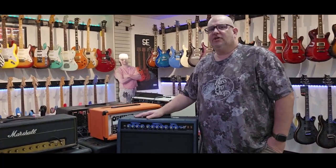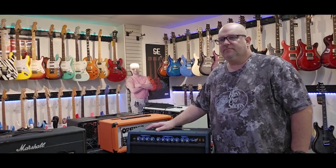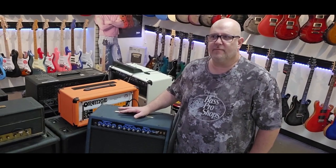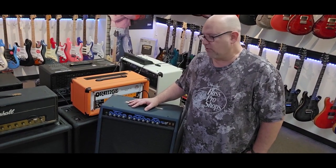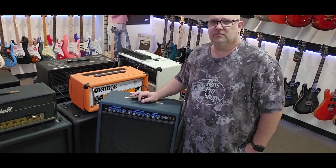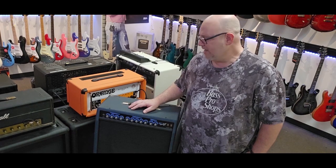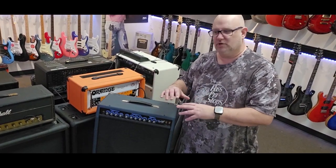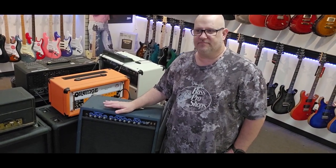Yeah, most of these, they're a little bit lacking on the gain, so we restructure four of the gain stages in this thing and boost them up. And then they act like they have a kind of parametric EQ, the way they're designed, because they don't use a cathode follower to push the tone stack. So there are a lot of real intricate tricks that I do to get them sounding the way you want. And that's why you can move every little knob a little bit and it really does a lot to these things. So you have to kind of tame them down. They're very honky when they come from the factory.